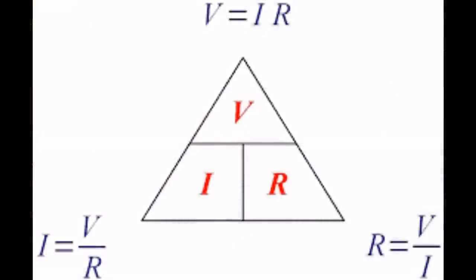Now, of course, in the UK, we get a fixed house voltage at 230 volts. And, of course, in USA, I think it's 110 that you get. So your voltage is usually fixed by your supplier. So we have these two things that are fixed: voltage and amperage. We can't go more than 6, and we're supplied 230. So the question becomes, what resistance do we need? Well, to get that answer, we can go straight to our Ohm's law and use V equals IR.